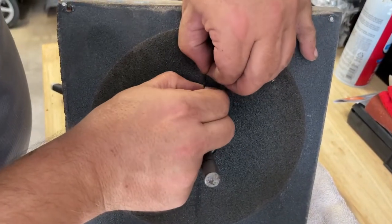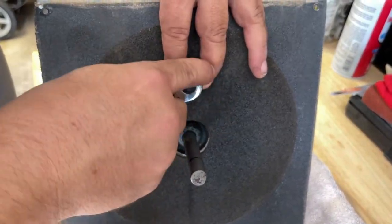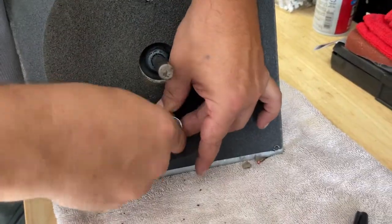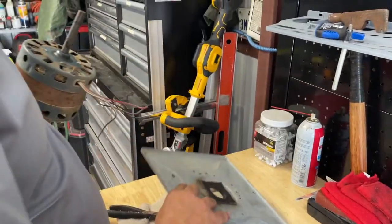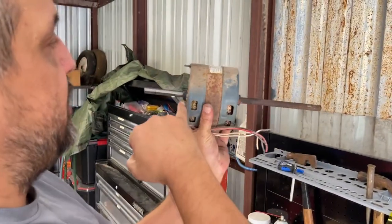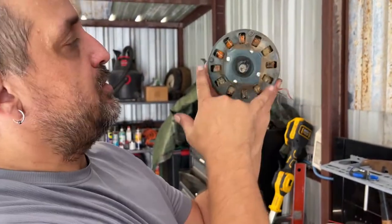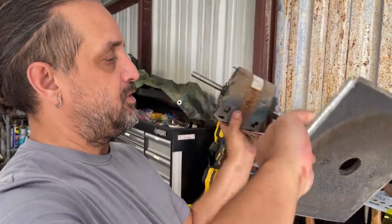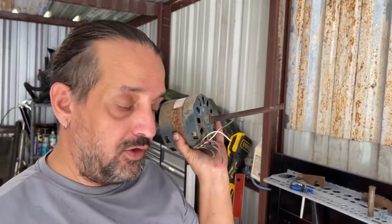There's an upper bolt here - there's no way to do this without ripping the styrofoam, just be careful. Expose the bolt there and there'll be one underneath. There's your motor. Now the bolt patterns - pay attention - they're upper or lower, at least on my '99 Bounder. You want this bracket to be at the bottom. These bolts need to have their extensions out on this side because it's supposed to fit up flat against this panel.